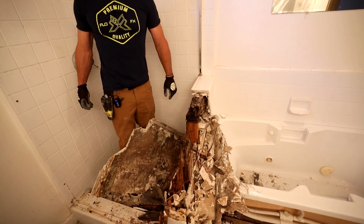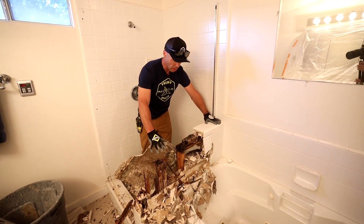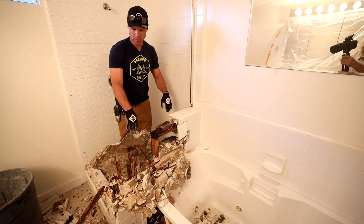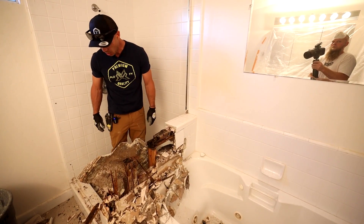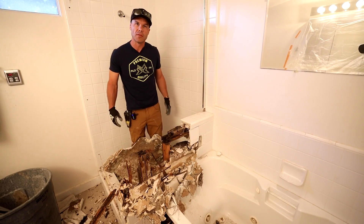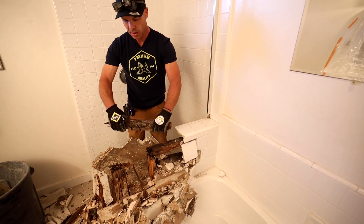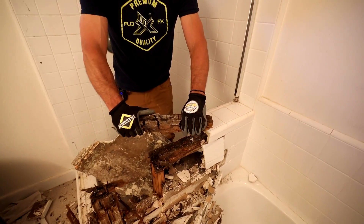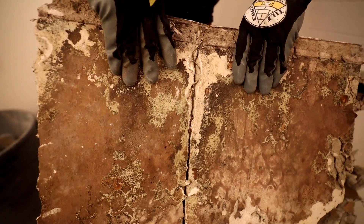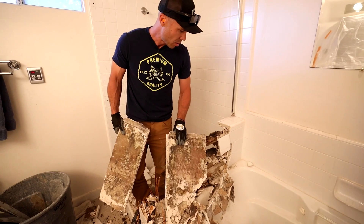Usually we can do without waterproofing on the walls because the water just sheds off. But once it hits a horizontal surface, we really need to waterproof it. Otherwise water can sit, find a crack in the grout, or the shower door can poke holes in it. Once that water has a horizontal plane, it just soaks in. This whole thing probably should have been hot mopped or at least had tar paper on it. This was done before they had RedGard and topical waterproofing. That's the two-by-four — and that's what's happened to it. The chicken wire, once it gets a lot of water in it, actually rusts and comes apart. You can see the chicken wire just rusted out so it loses its structure too.